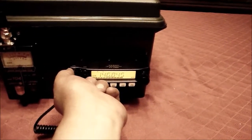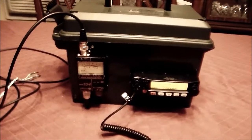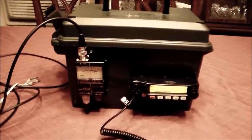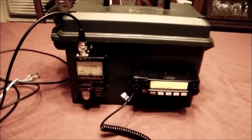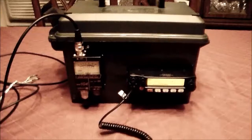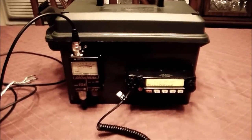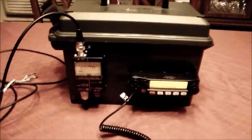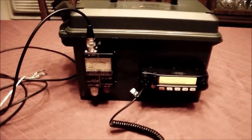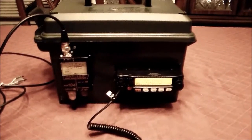I really don't want to put people's conversations on YouTube. Let's check out that meter there — let's see what we're doing. I don't know if you can see how that meter is going into the red. You want to keep it at like 1.5, so this antenna is not tuned. A mobile antenna is meant to be sitting on the car — the car itself works as a ground plane for the antenna. But that's why it was important to have that meter.